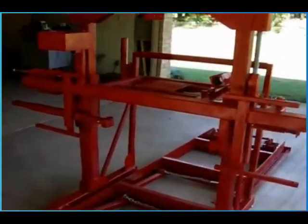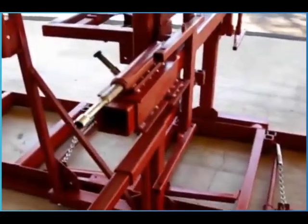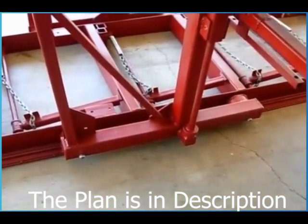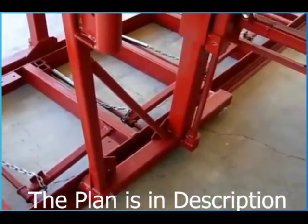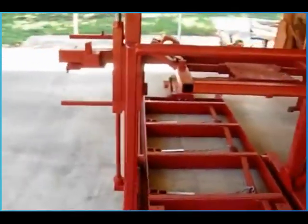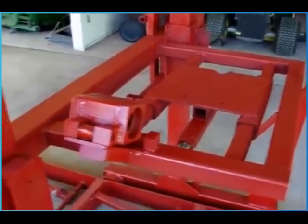In effect I have a real good drive system and I don't have to fool with engagement and disengagement. I just lower the speed of the engine and everything works well. The engine has an electric start, which gives me a generator, so I have a Warn 1700 winch that works great for raising and lowering the sawing assembly. It's just pulleys and cable, and because the saw mechanism is so heavy it's rock steady and parallel. I can cut an 8-inch slab from a 7-foot board, 24 inches wide, without it varying in thickness at all.